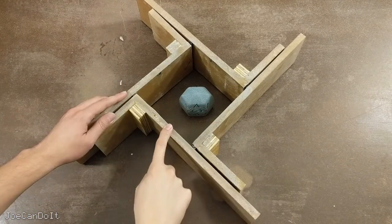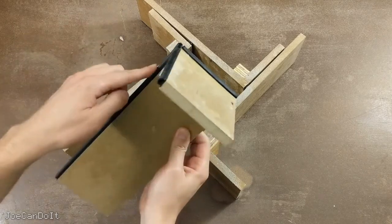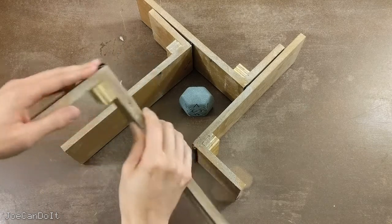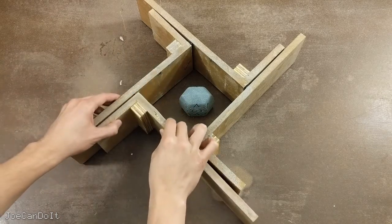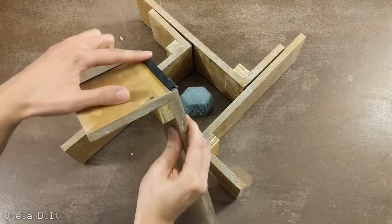For those of you who built this mold box, you'll notice that on the side I have the same window insulation that I put on the bottom. I did that to help prevent silicone from leaking. Even though we'll be using clay later in the process to help seal it, I use this for another layer of protection.